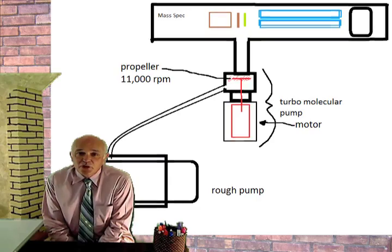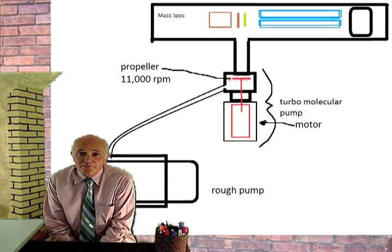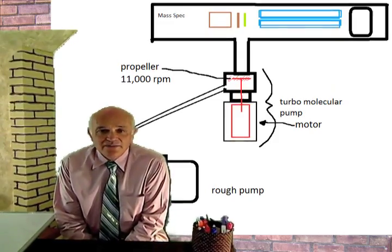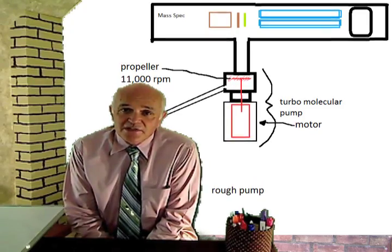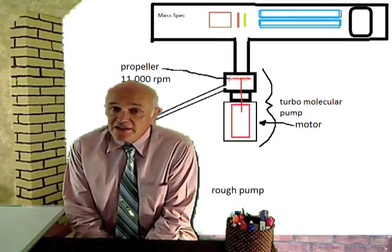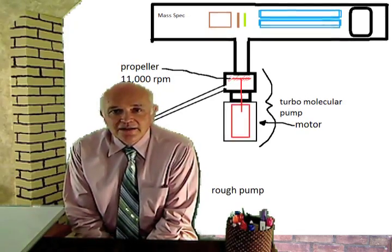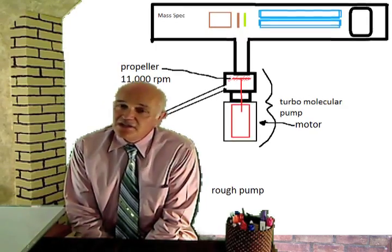The rough pump is a hydraulic system and the oil is supposed to be changed out once in a while, though I have never seen it changed out or seen a rough pump go bad or fail. The turbo molecular pump is supposed to be like a light bulb — it works and works and then catastrophically fails and you need to buy a new one — but I never saw a turbo go bad. The hardware for the vacuum system is very robust and not much of a problem.